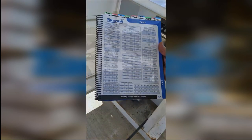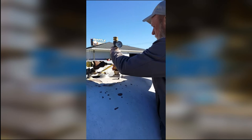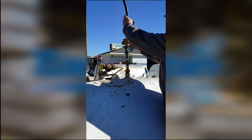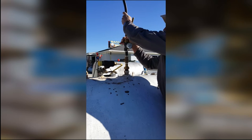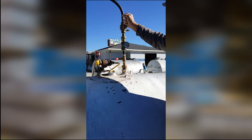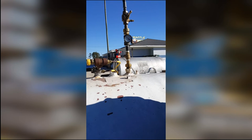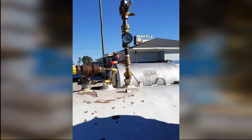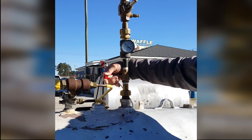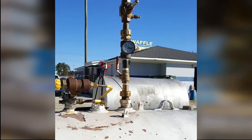Okay, let's get started. Sammy's hooking up this tester here. We're just going to run product back into the tank. Always make sure you introduce vapor to your propane pump first and then liquid — we've already been pumping cylinders this morning so we've got that taken care of. When Sammy opens this lever here we're going to see what the pressure is — that's the beauty of this little adapter. You can actually check the pressure inside the tank. We're running right about 90 pounds of pressure. The tank's been in the sun this morning and being used a lot, so we're going to turn the pump on now and let a little bit of product circulate through. We should be getting about 90 pounds of differential pressure.